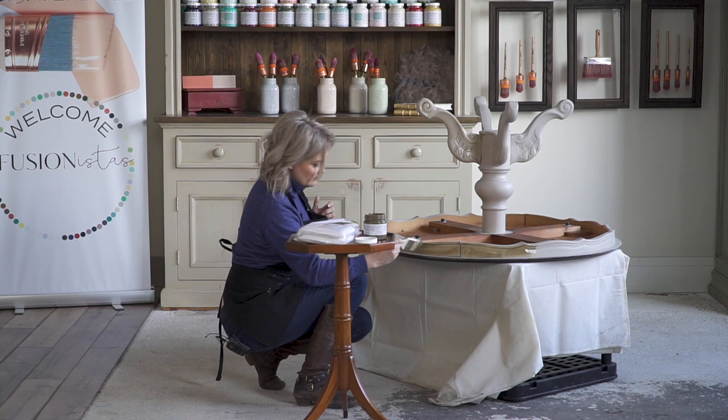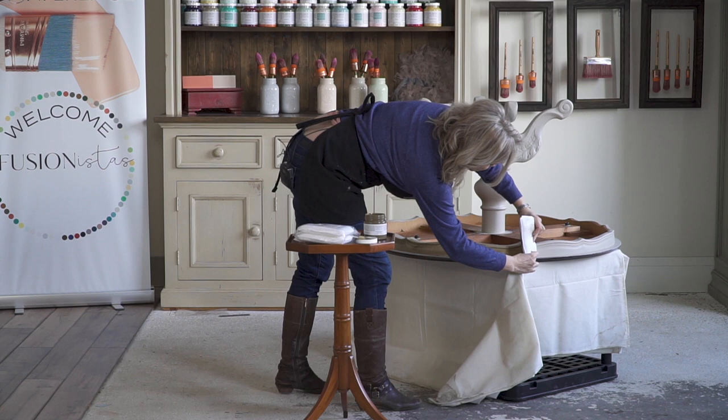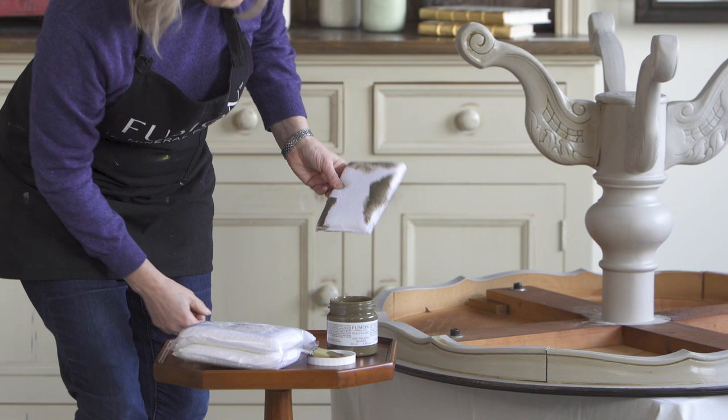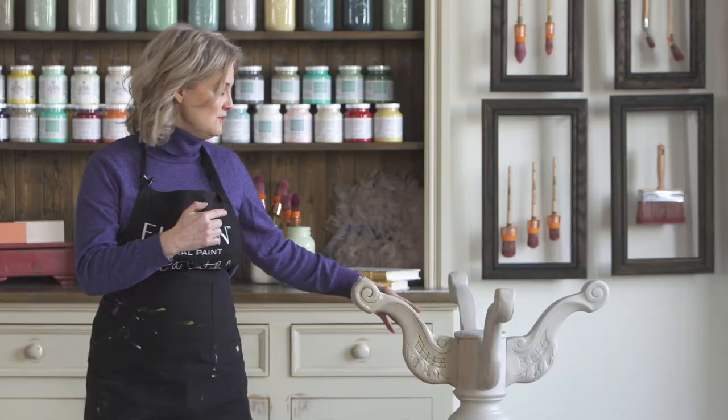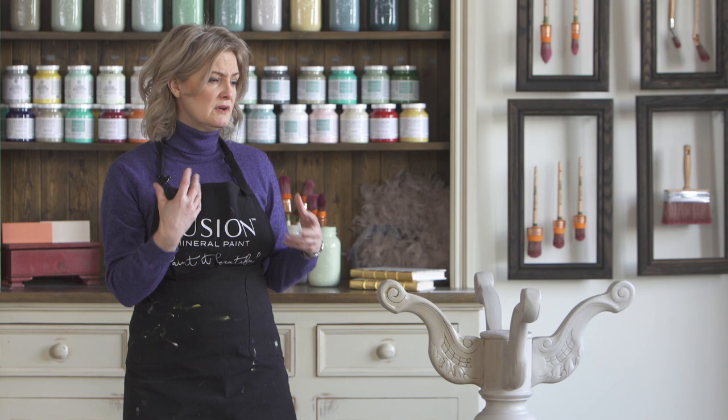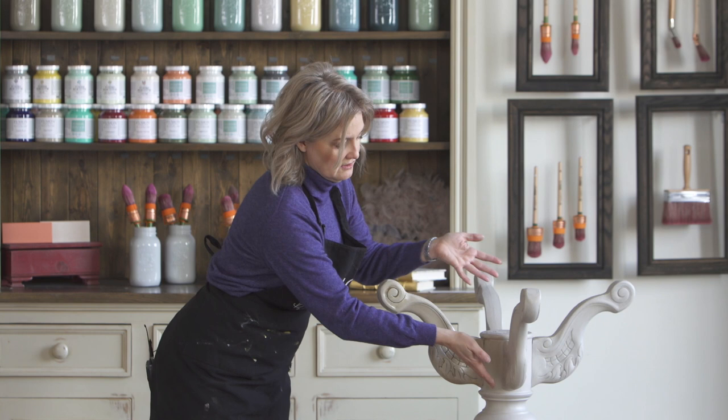Just to show you here, we'll remove the excess — and see how it just stays behind in the line there. A little tip: if you wanted to go for a slightly darker or different color than this darker brown Antiquing glaze, you can customize your own color. I chose this one because it matches the top perfectly. However, if you wanted to do a blue glaze, you add about 20% of say midnight blue into 80% of our clear glaze. You can adjust those ratios depending on your intensity — you can totally go for a colored glaze on this type of project to truly customize it.